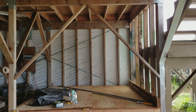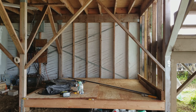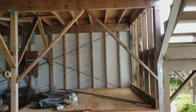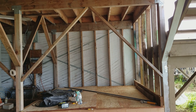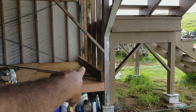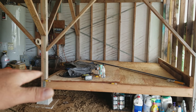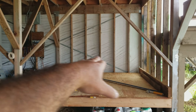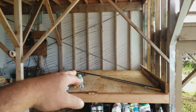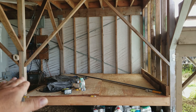The issue is that I cannot use this space for the power room. I could technically use it, but it's going to be very confined as far as the amount of room I'll actually have. Because I have a concrete slab going around but nothing in the middle, I had to attach my frame to the existing wood frames and four-by-four posts. So I had to find the highest point and pull level from there.